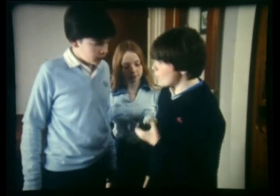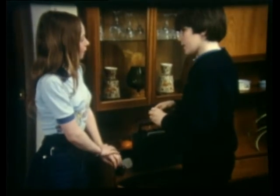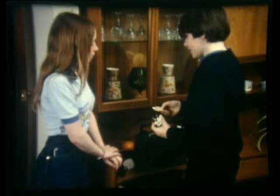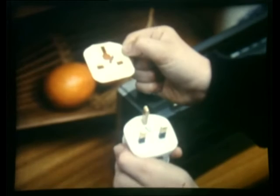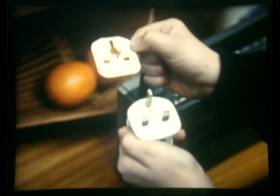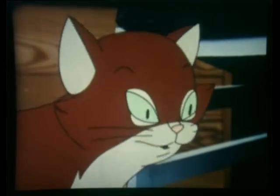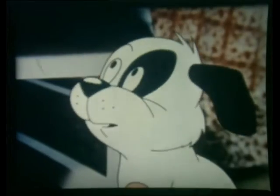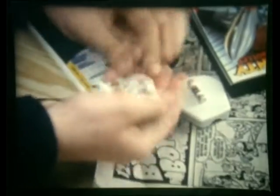Wait a minute — I know it, there's a spare. Shouldn't you wait until Dad gets home? Fitting a plug is easy. There's a label that tells you what to do. Green and yellow for Earth, brown for live, blue for neutral. Fitting a plug may be easy, but it still makes sense to let a grown-up do it, or at least check it after you've done it, to make sure the right colour is in the right place and it's got the right fuse.